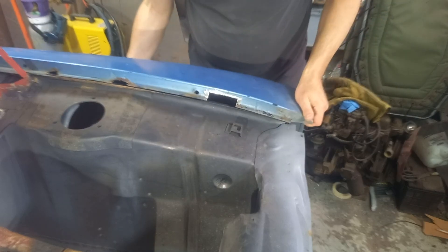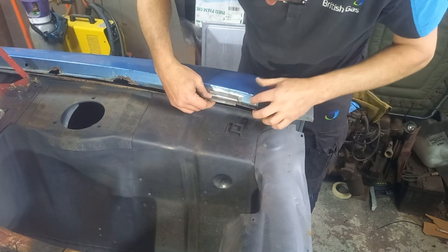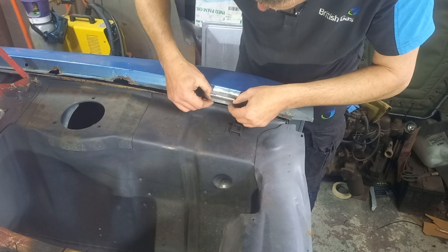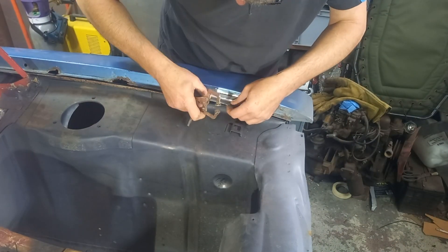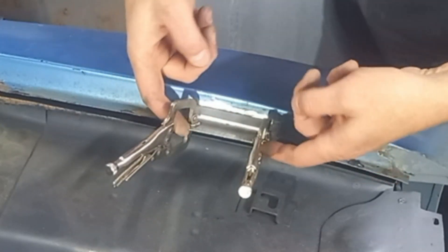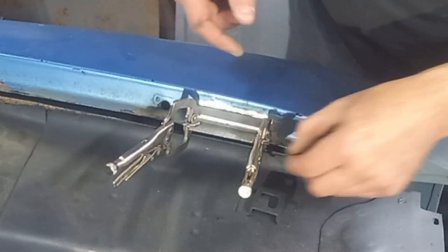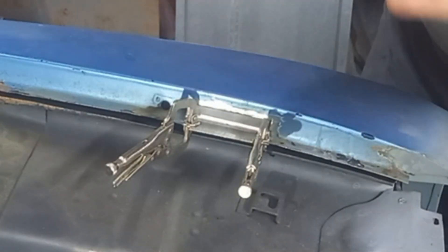What we'll do is wedge it up somewhere so we can get to it, and start tacking it in place. That angle ties up quite nicely with those angles at the corner. It is tighter there than it is there, so it looks nice. Let's clamp that in place now and get a couple of tacks on it. You'll see that it's all sticking out too far there - I've done that on purpose. It's easier to get a weld between two bits of metal on the end because the heat can then soak into the bit that sticks out rather than just blowing the end away.